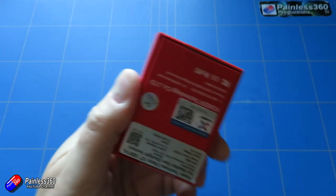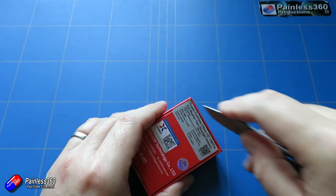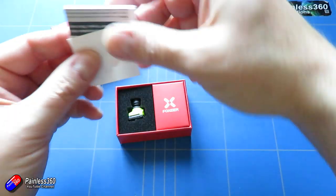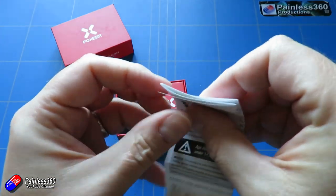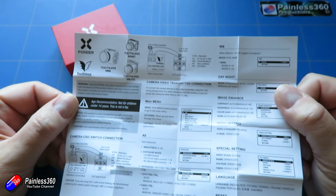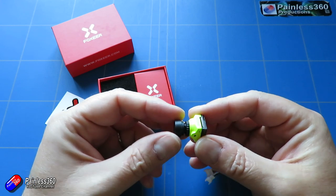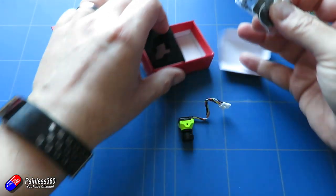The Nano Toothless 2 Starlight FPV camera has the same low light sensitivity and is available in two colours: black and fluorescent green — I've got the fluorescent green one here. It has lots of different modes for the way that you fly: cloudy, sunny, sunset, indoor, and dark night settings. It has a half-inch CMOS sensor, camera control just like its bigger brother, and the ability to plug in an on-screen display. It's 4:3 and 16:9 switchable, PAL/NTSC switchable, with 1200 TVL lines.